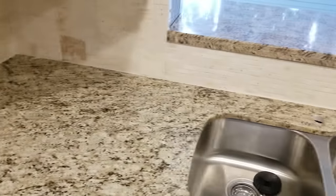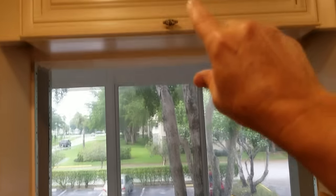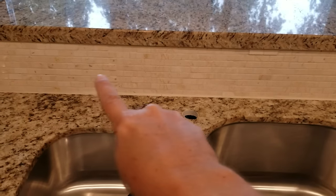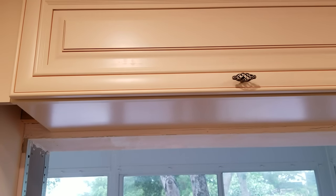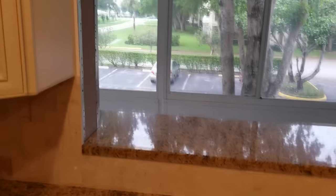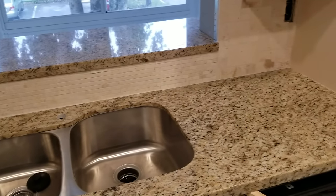This is how you do the lighting, folks. It's important too — especially above the sink: had I not put this light far enough out in front, we probably would have had a shadow on the backsplash behind the sink caused by the upper cabinet. For some reason, a lot of builders think you only need to put the light 12 inches in front of the cabinet, and that is just not true. It's got to be 24 inches in front of the cabinet, which by deduction means you have to put your light 36 inches off the back wall. That's all you have to remember.